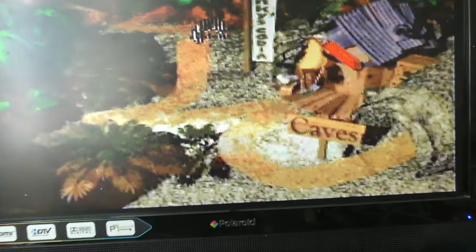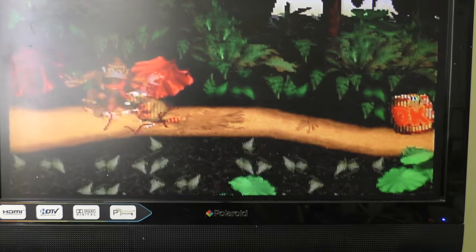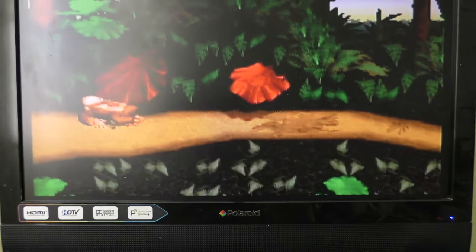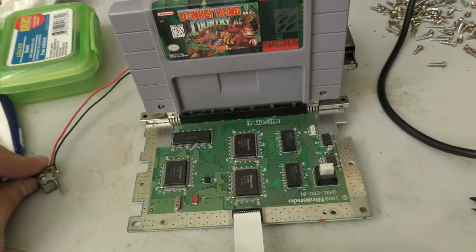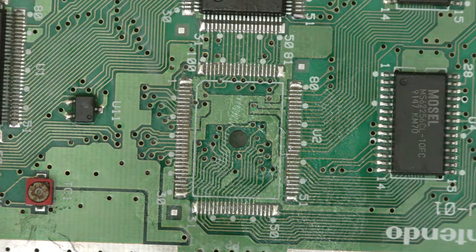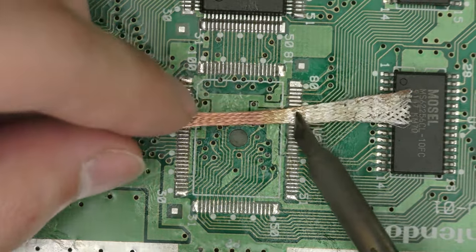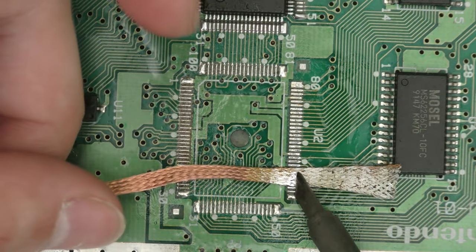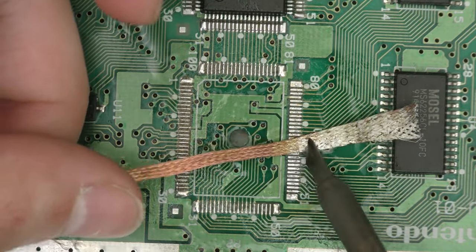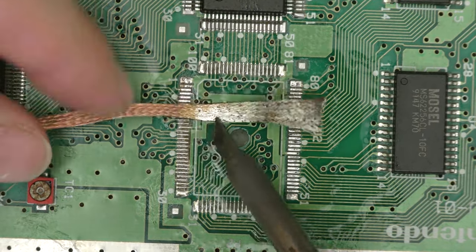So the PPU2 didn't solve the issue, so now I'm going to be swapping the PPU1, hopefully then that will solve the issue. So to save some time, I've already pulled the chip off the board, and if swapping the PPU1 doesn't solve the issue, then I have to look for broken traces, or perhaps one of the video RAMs are bad, or the work RAM.